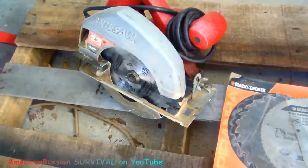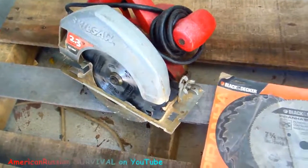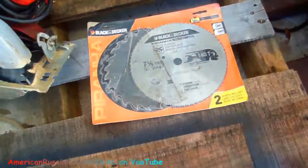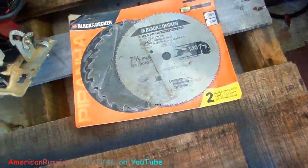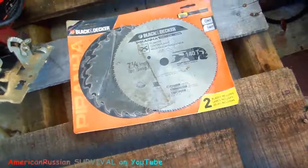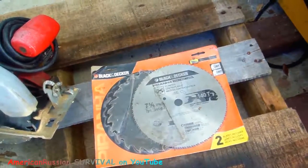There are several uses for it — a lot of different uses if you start looking for brackets and things like that. One problem is it's not really bendable unless you heat it up, and then you lose its temper and change the properties of the steel. But as far as it being very strong and tough, it's about the best stuff you can get. Why throw them away?